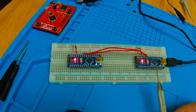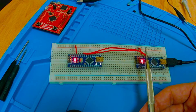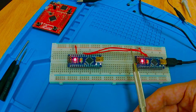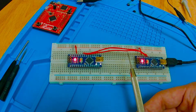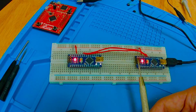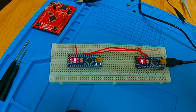What we've got here are two Arduino Nanos on a breadboard, and they're doing something kind of special. They're sharing data between two wires using a protocol called I2C. It is possible to run into difficulties when you try and implement a system like this, so we want to talk about how I set up this basic example and use an oscilloscope to see what's actually happening between these two lines.